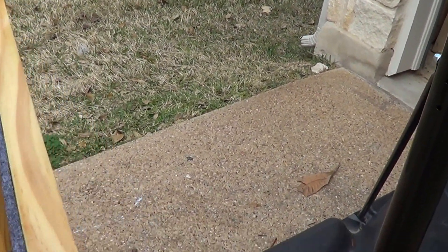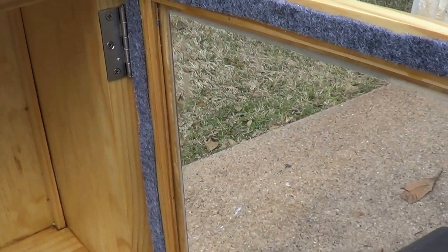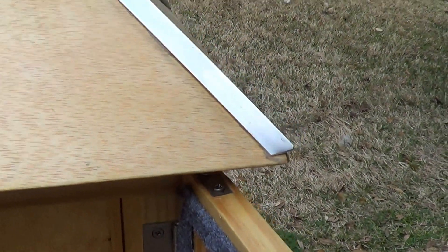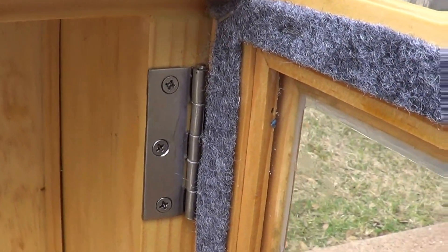I think it should be sturdy enough. I did go a little deeper than I probably should have into the sides — it's kind of a nice look and it's probably okay, but maybe I should have left a little more material long-term if the wood starts cracking. For the hinges, I got some self-closing hinges that I thought were okay, but I must have measured wrong because there wasn't enough material on the side. So in the end I just decided to go with some very basic stainless steel hinges. I did countersink them into the door to give it a little more rigidity, but I was concerned about the hinge sitting down into the wood and capturing moisture, so in the end I just decided to mount those flush.